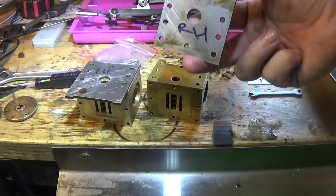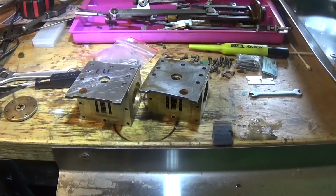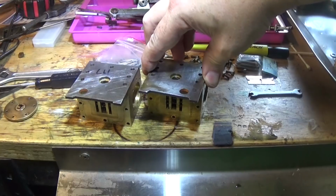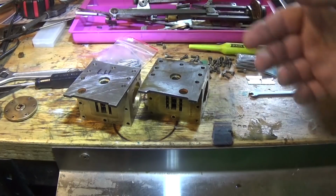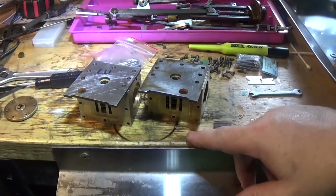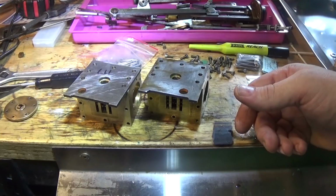These have got separate spacer plates, because the casting's obviously been a little bit undersized. Or, more likely, they were castings that were used for something else as well, and this was the workaround for it. Someone's made up these nice steel plates. They're all nice and flat, and they bolt between the frames and the cylinders. So I'm going to bolt these on where they go, sort of, and set a straight edge across and get some sort of an indication of whereabouts they are and where they should be.